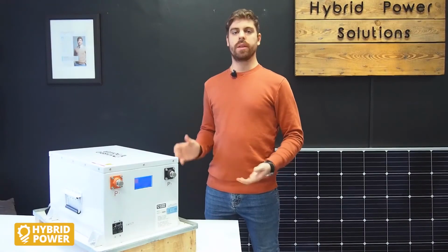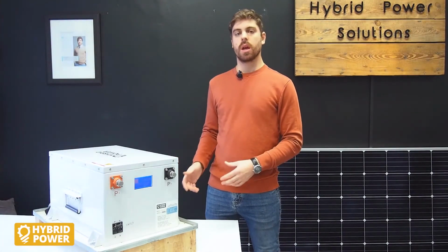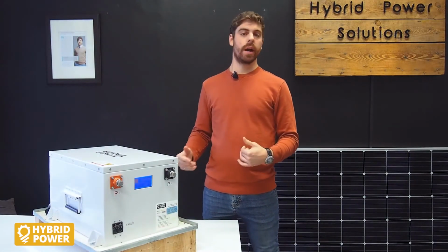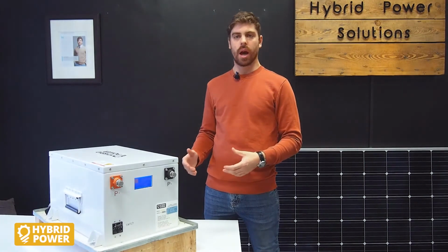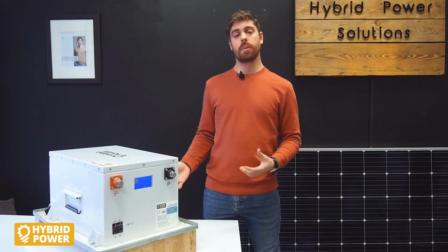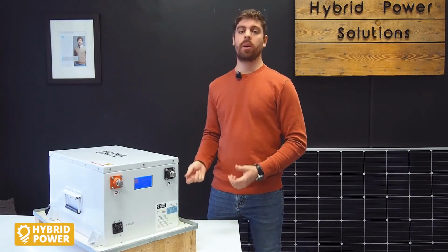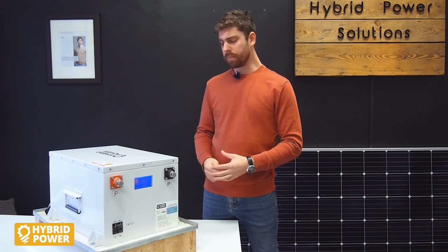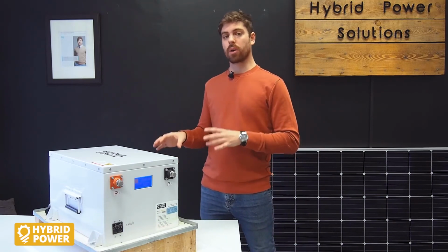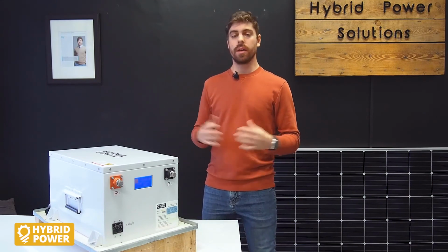So there you have it, the unboxing of the Power Tower battery from Hybrid Power Solutions. Once again, this is a 24 or 48 volt model, 3.98 kilowatt hours. That equates to, on the 24 volt model, 156 amp hours, and on the 48 volt model, a 78 amp hour capacity. And once again, that's lithium iron phosphate. These are meant to go with the Power Tower system, although they can be used with any application.